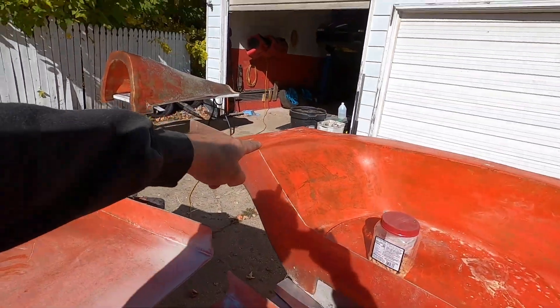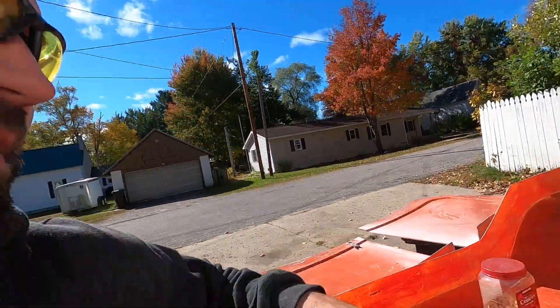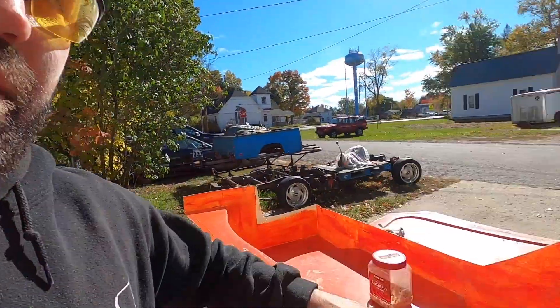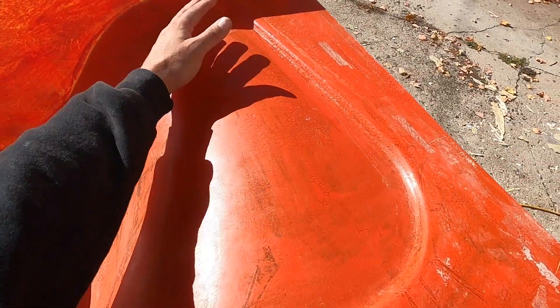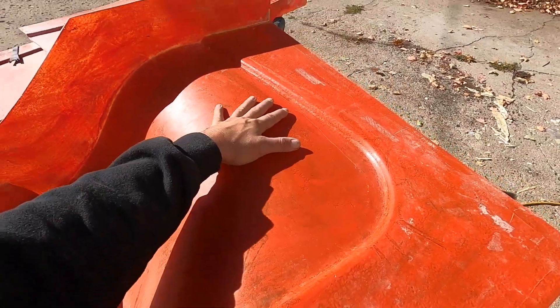What I'm doing now - this is very difficult with infusion - I'm gonna prep these so this mold will bolt to that mold so I can make the part in one piece. The difficult part is I have to be able to get things in there when it's clamped tight. You can't fit your hand in there, so it's gonna take some creativity. I'm gonna try to document that. If it doesn't work, we tried, but I think it'll be fine.